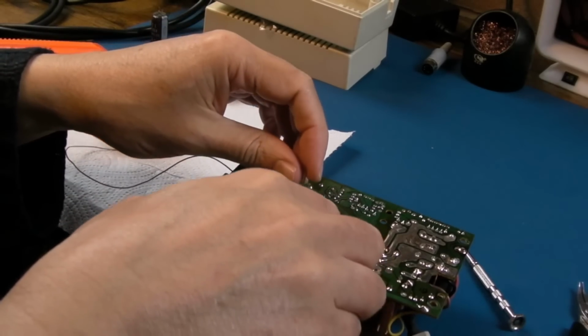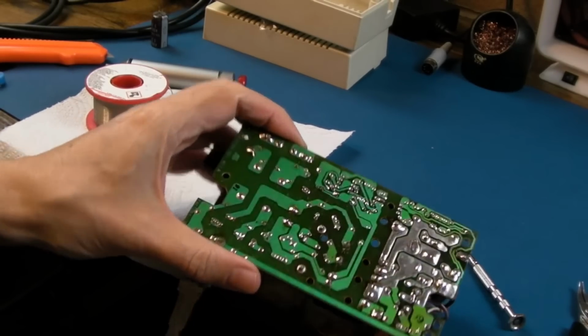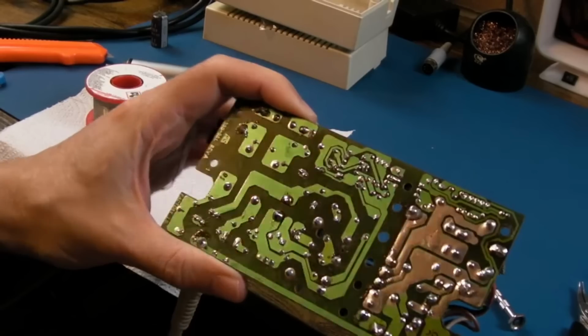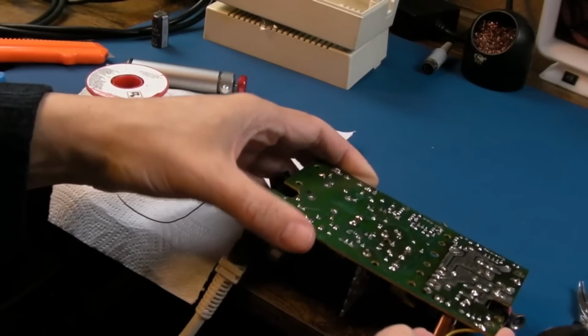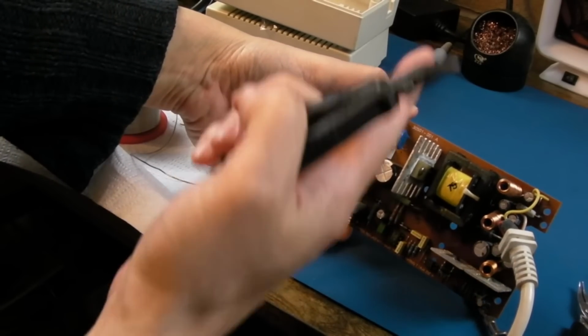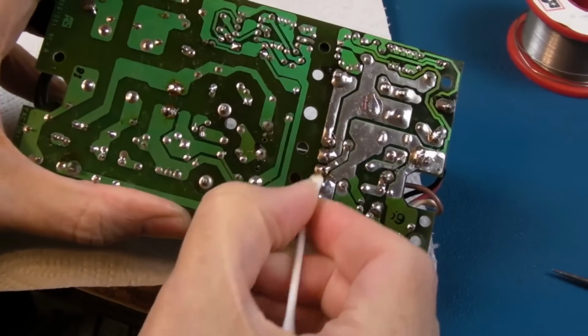We'll trim that down, and I'm going to have a clean on the underside of that PCB in general, because it is a wee bit dirty, you can see that. And I'll inspect for dry joints, but I think we did that before. Anyway, it's on, ground towards the top. I'll just confirm that is how the other one was fitted.